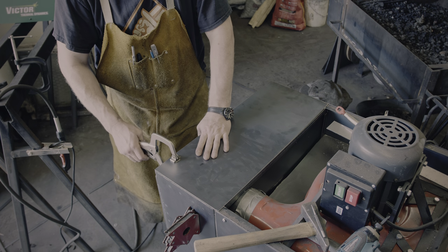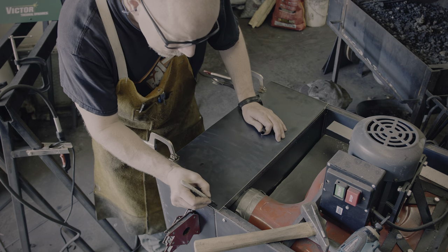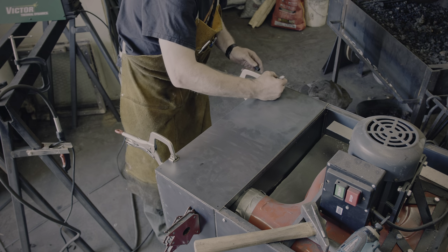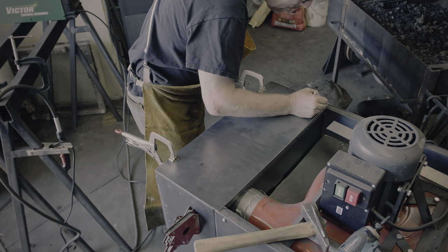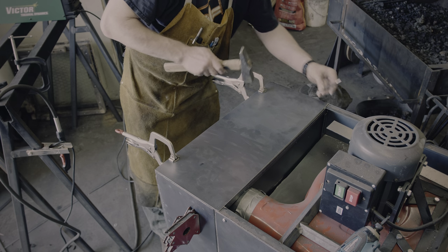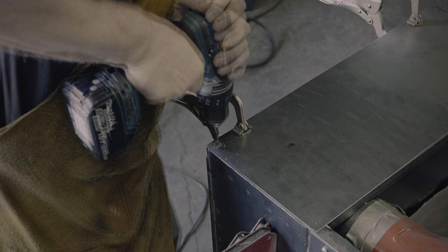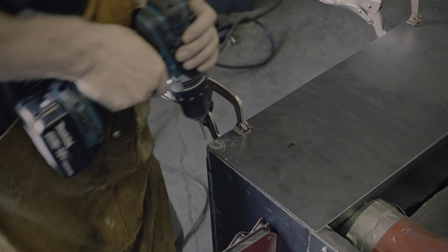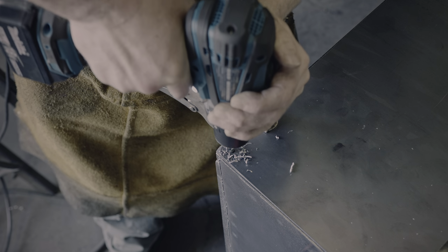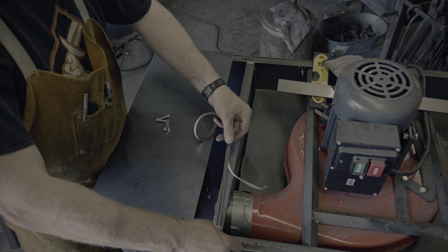There's not all that much work remaining. I have to close up all sides, make a place for the filters to go, and make an inlet. My process is the same. Drill the holes all the way through the angle iron and weld a nut on the inside for the screw to grip. I had a little bit of a transition, but some weather stripping will close that up. I told you, I'm just cobbling it together.